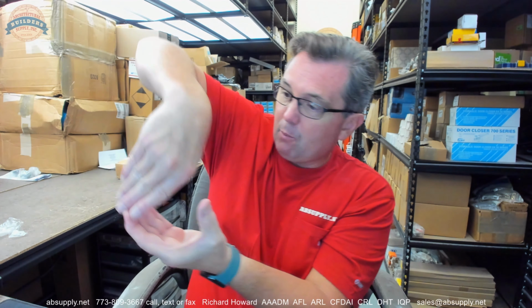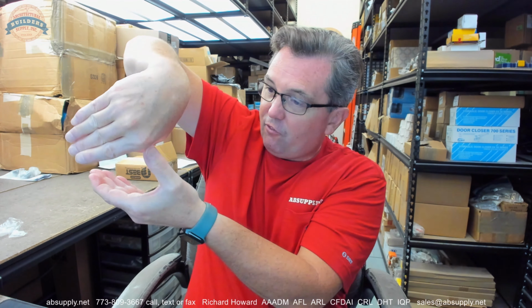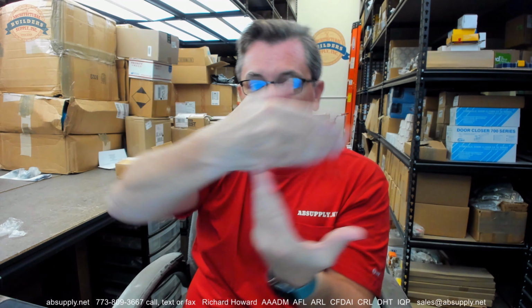Now here's the meat of it. The cam is included because it is inside of the operating parameter of the length. In other words, the depth at which the cylinder penetrates a lock has to include the cam to judge that the cam operates in the sweet spot of the mortise lock, or approximately in the middle of the throw lever that operates the bolt. So the throw lever is the yoke that the cam will come through and kick back and forth to lock and unlock your unit.